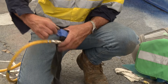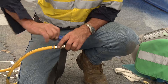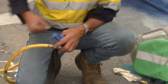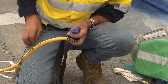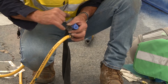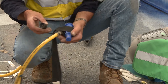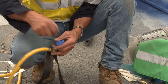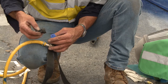But if you have a look on the other end of this unit, it says 'hot.' If I take this exhaust port off, you'll see that in the end of this there's a series of small holes. Now, as you can see, because this is a blast helmet, it's got remnants of abrasive dust in there — that's why it's important to keep all this stuff clean. Clean it overnight, blow it out if you have to, give it a rinse, blow it off again, reassemble it.